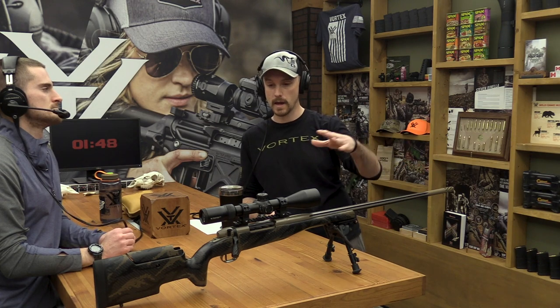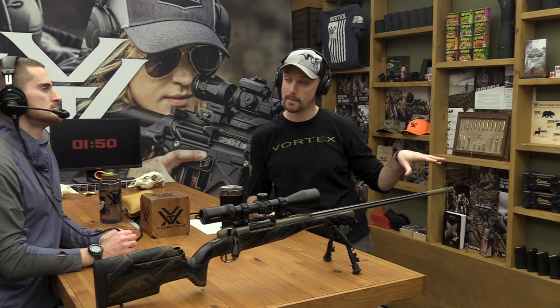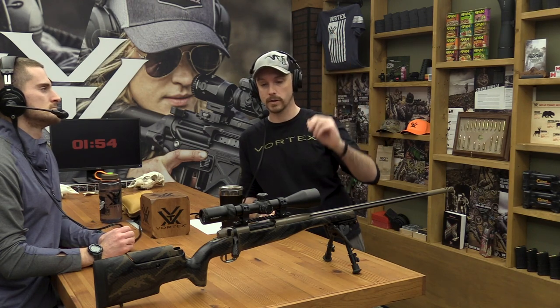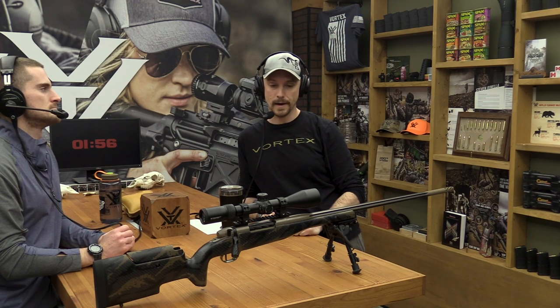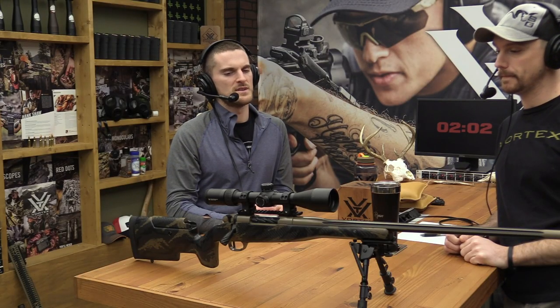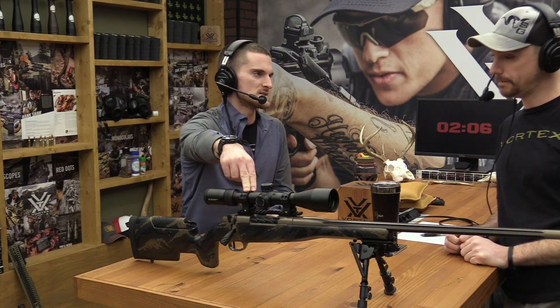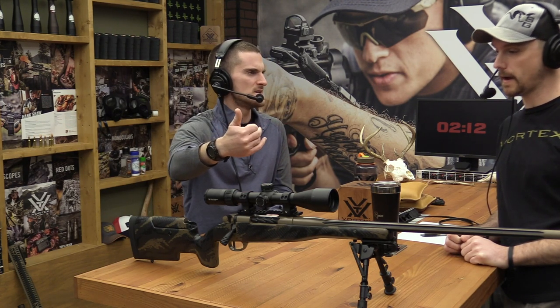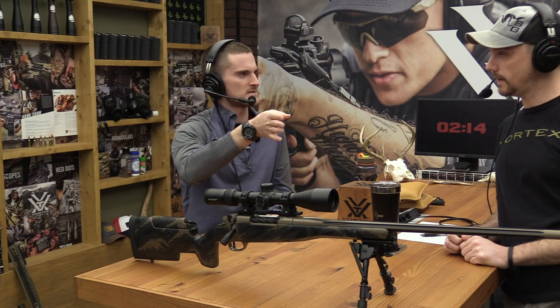So at that point, we want to drop down to maybe a 10 MOA base, and you're going to gain that back. You're still going to have a whole bunch of top-end travel. Those unintended consequences of the 20 are not often talked about. Exactly. And then other misalignments, too. Speaking of those, there's also the Burris Signature Z rings. That's another cant system in a way that can cant the scope in any direction, pretty much, right? Yep, not even just straight up and down, but side to side.